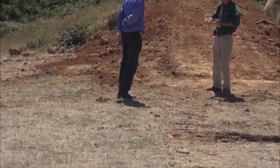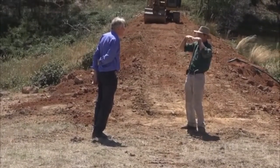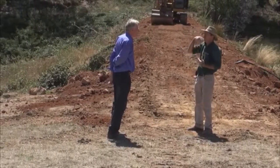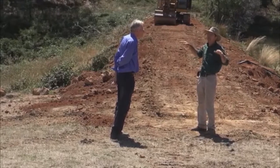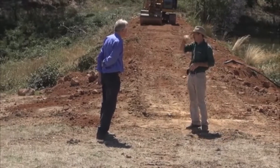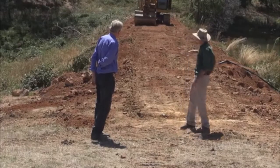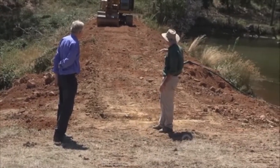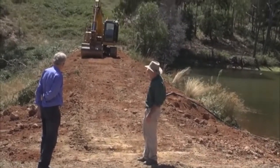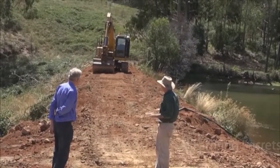The water actually sheets over it, as opposed to cutting and incising, which is what classically most Australian dams do. If we put it on a level sill so the water exits passively, it also dissipates all the energy, which is really what we want. It can drop a lot of its silt load in the swale. We only started this morning and will put another pipe in there just for aesthetics.